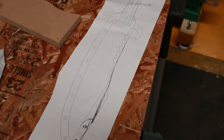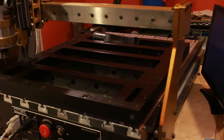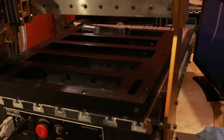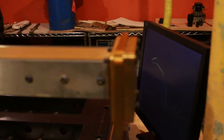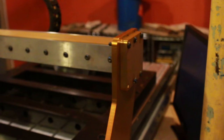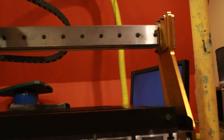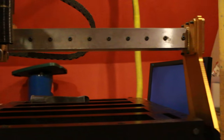Working on the sheath for the Big Jim Bowie knife, and that takes me back to the CNC router in the back room, which is causing me trouble today. I've got this vacuum table grid set up and I'm trying to cut an O-ring around the perimeter, but the right side of the gantry wasn't made correctly — there are slots in here. I talked to Ron at Romac CNC and apparently they missed a problem — I have about an eighth of an inch height differential between the left side of the machine and the right. I ended up cutting a groove on the left side and no groove on the other side.